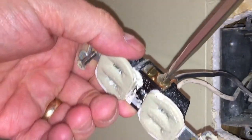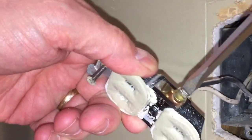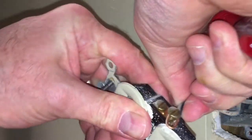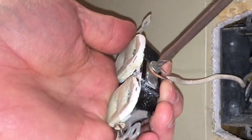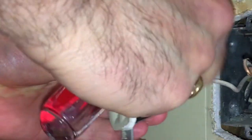Sure enough there's no power coming to this outlet. Next we need to disconnect the hot or black wire as well as the white or neutral wire from the old outlet. Now you may have noticed that there's no ground wire — that bare copper wire that you typically see. That's because these old outlets just weren't grounded. But that ground wire is secured to the metal box and we'll connect it to our new outlet here in just a moment.